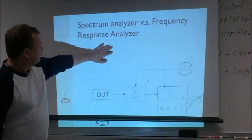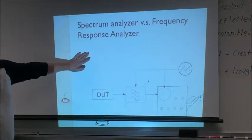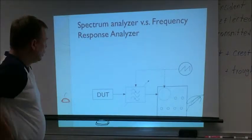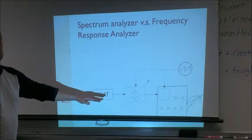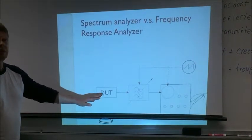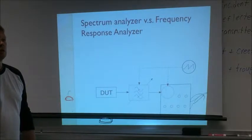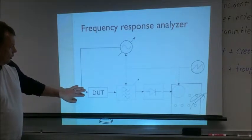The difference between a spectrum analyzer and a frequency response analyzer is that with a spectrum analyzer you don't feed the device under test with anything — you just look at the output. The term 'frequency response analyzer' means it's responding to something you're generating. In a frequency response analyzer, you provide the input to the device, and the device can be completely passive — it doesn't have to generate anything.